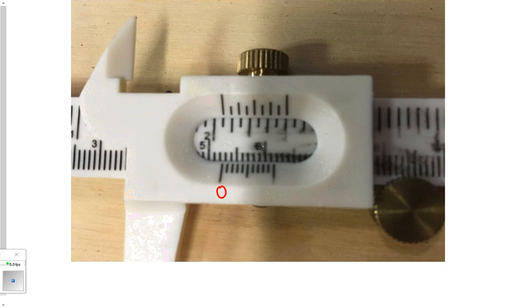Last one — find your zero mark. There's five, there's six, so I know this is 5-point-something. Five point one, five point two, five point three — where does the zero come? It comes between the two and the three, so this is 5.2-something. Now start counting the vernier scale: one, two, three, four, five — I feel pretty good about five. So the answer is 5.25, and then estimate one more place and put a zero: 5.250 centimeters. And that's how we read the caliper! Hopefully you've got a solid idea and you'll be ready to practice with the caliper.